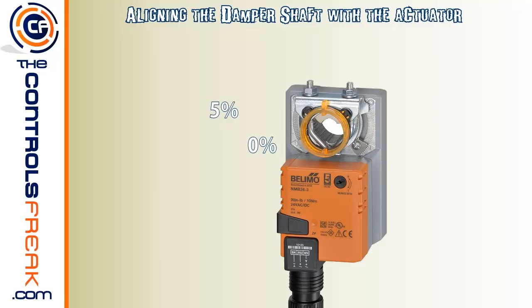Alright, aligning the damper shaft with the actuator. We're going to make this quick. Here's the tip. When you go in to put in the actuator and you slide the actuator, you're going to have your shaft here, and it's usually going to have a mark. Make sure you crank that sucker down to the shut position, which is going to be vertical in this case because you have airflow going that direction. So you want to crank that down shut by using some channel locks or your hands.